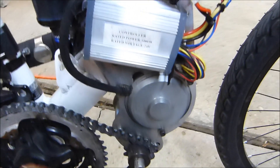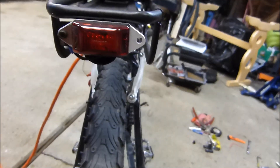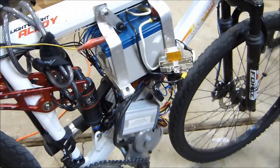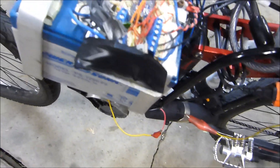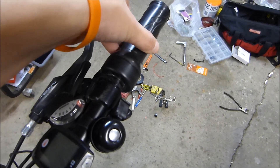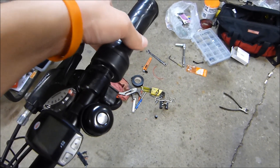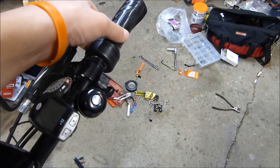Here's a little automotive relay for the 12-volt to the brake light. This is a three-LED trailer brake light — it pulls a couple amps and it's pretty bright. Everything works and it's fused. I've got a lock mounted up here for when I do some testing or go to the store. Here's the brains of this e-bike. Starting with the throttle — here's a hall effect throttle from Kelly Controller; this thing works pretty good. It's a little loose, not like a motorcycle with some resistance, so when you go over bumps you'll be throttling it. But other than that it works pretty well, and I do have cruise control, which makes life easier.